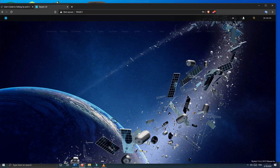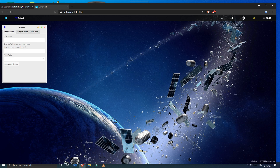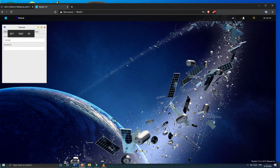Now let's take a look at the network menu. This is an important part if you want to change the OtherNet SSID, your login username and password, or to connect the DreamCatcher board to your Wi-Fi network. You do not have to change any of this — it is optional — but I would recommend connecting your DreamCatcher to your home Wi-Fi so you don't have to constantly disconnect from your home Wi-Fi and reconnect to OtherNet or vice versa. Under the network mode tab you can change the hostname and password. Under the hotspot tab you can change the OtherNet SSID that is normally broadcasted — name it whatever you like and assign a password or leave it blank. Right here under Wi-Fi is where you connect to your home Wi-Fi; simply enter your home Wi-Fi SSID and password, then go back to network mode and change the Wi-Fi mode to connect to Wi-Fi router.